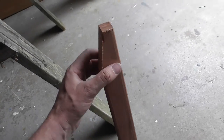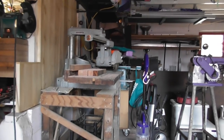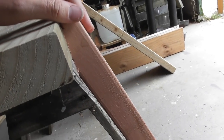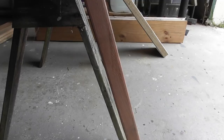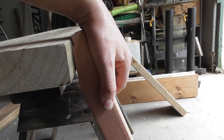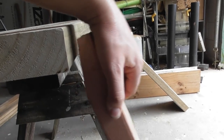I've got a test angle here — I set it at 75 degrees on the radial arm saw, which is 15 degrees off the 90. Looking at it compared to the previous sawhorse, it's not quite as much of an angle. Since they're going to be a bit higher the legs will go out further at the bottom, so I might just tweak it another couple of degrees in that direction — let's see how that goes.